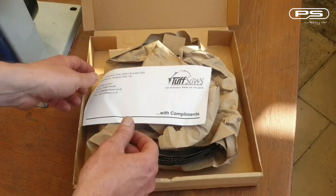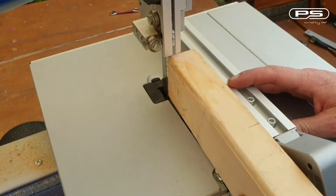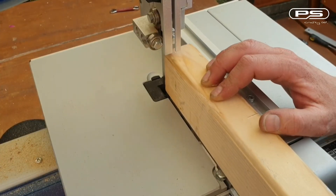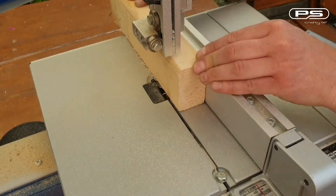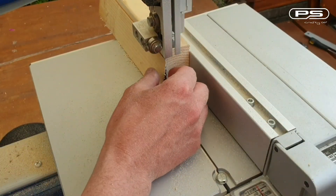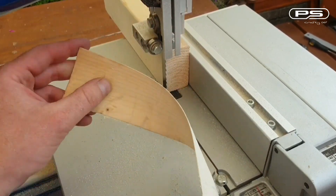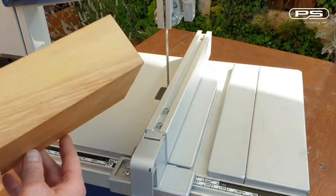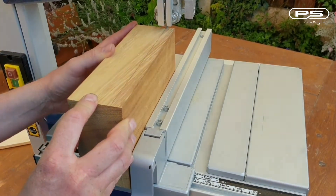So I bought a set of good quality blades and had a go again. This is a 1/2-inch 6 TPI blade — let's see how it goes. The band saw setup is the same. Not bad, not bad at all. What about re-sawing this African Iroko — 120mm high, which is the maximum throat capacity of the saw? Let's try, just need to feed it slow.